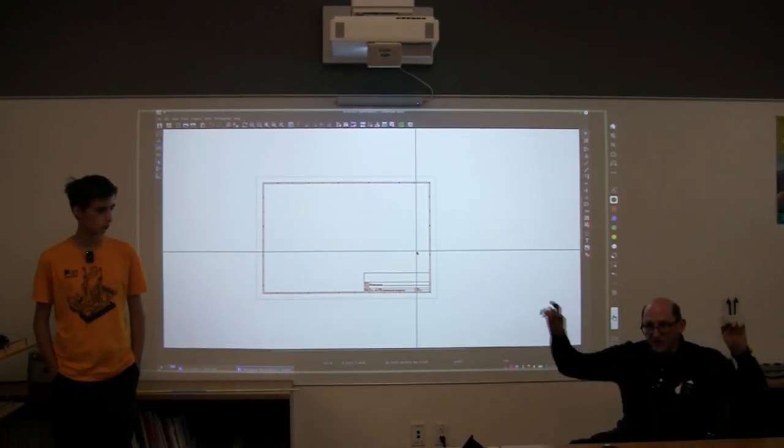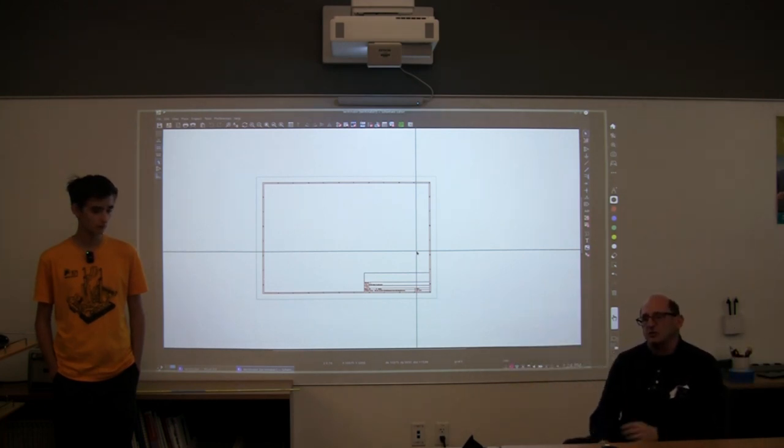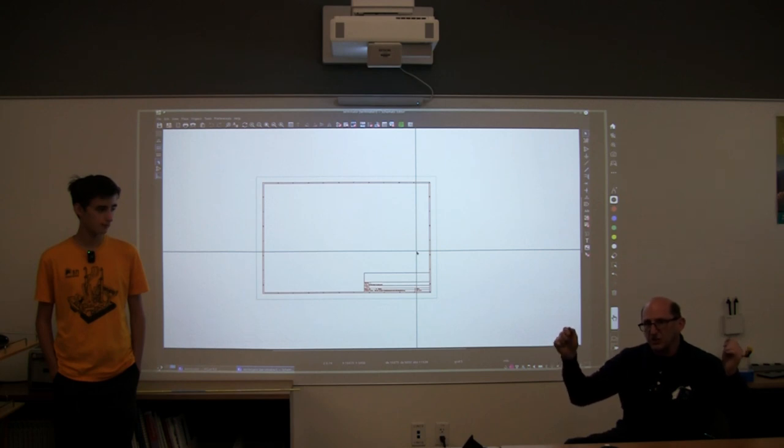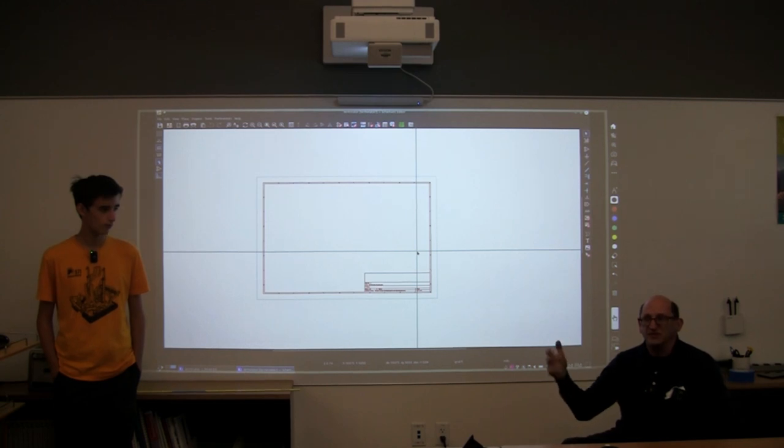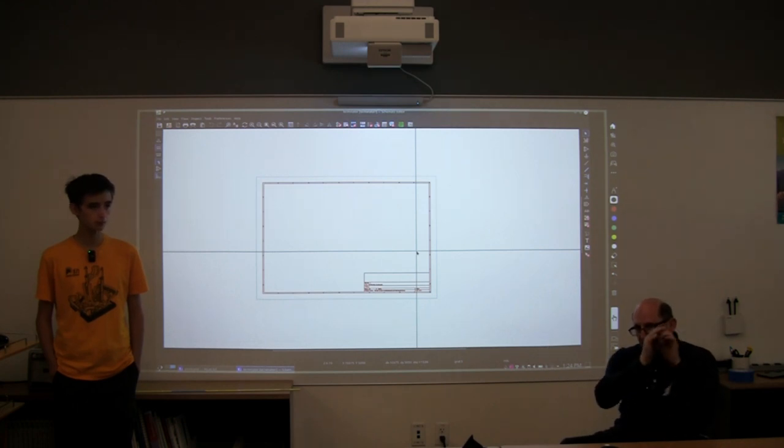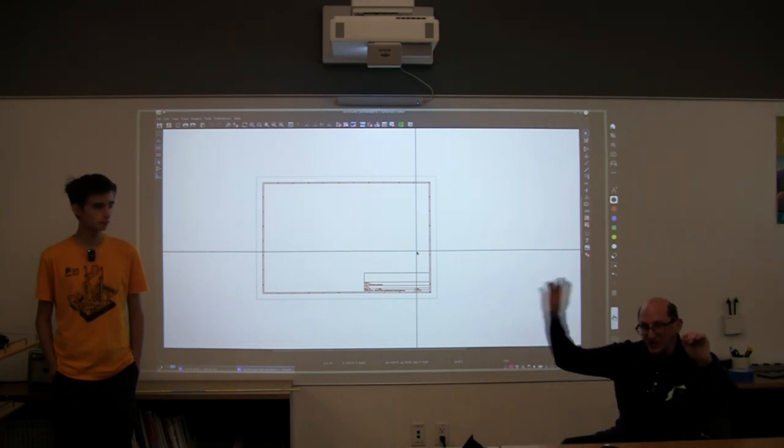a pair of wires that ties between these various controllers. And then you need termination on it in order to prevent electrical reflections on it. So it's switching at pretty high speed, and you need to prevent these electrical reflections. What termination is for is to come up with something that matches the impedance, so it kind of deadens it.